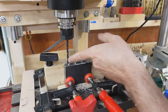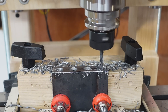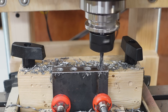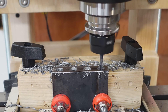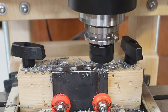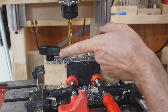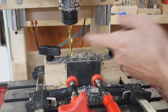To avoid having to push down so hard I'm going to pre-drill with a 5mm drill, although that's risky because a bigger drill might grab. The deeper I'm drilling, the more it sounds crunchy down there — I think that's the chips not clearing adequately and grinding between the drill and the hole. With the pilot holes drilled I'm now ready with the bigger drill, which is actually half a millimeter smaller than my target hole size, because last time the hole got too big.